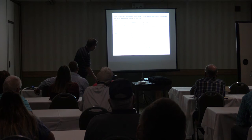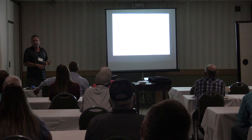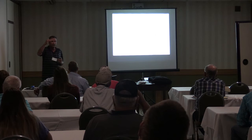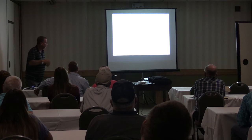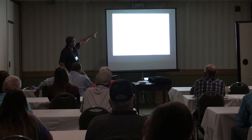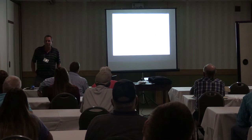If you think anything's going to happen, you've got something that's been burned through at least 12 times on a fence that was about 27 years old at the time. What you think about is whether fire may weaken the metal, and whether fire's going to melt the paint, which can cause rust and damage to the post over time. We looked at varying heights to see if there was any difference — 40 centimeter, 80 centimeter, and 120 centimeter heights. The dashed line is the industry standard for metal hardness at 83. All the posts we tested were well above the industry standard of 83, showing no damage.